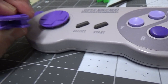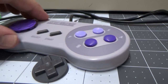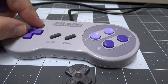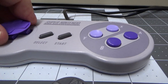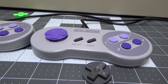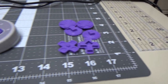This version here was too short — it was touching the edge of the face of the gamepad. This one is ideal. One has a more pronounced bevel, the other has a bevel that only goes halfway. I was worried about torsional rotation, but it doesn't seem to rotate at all. Both designs seem to work just fine, though I think there's still a little bit of interference I could reduce.